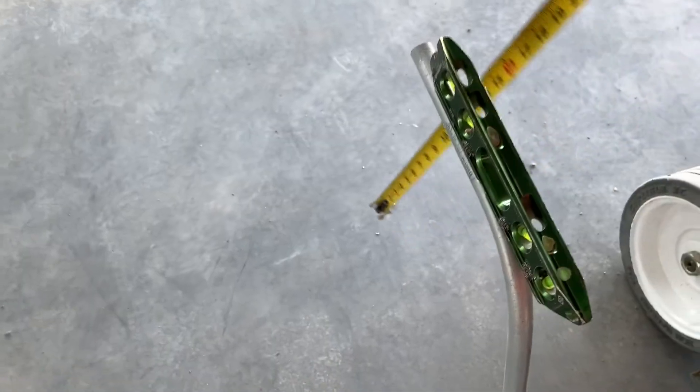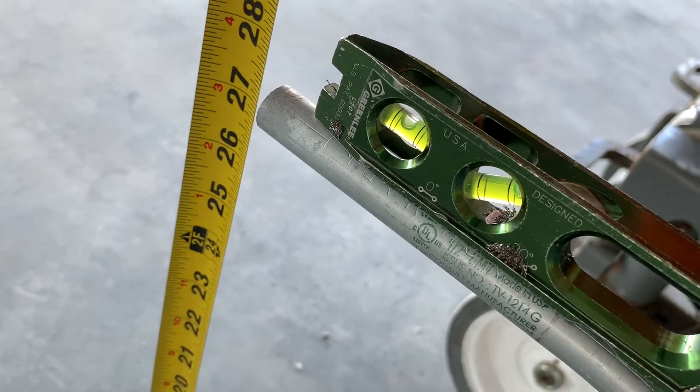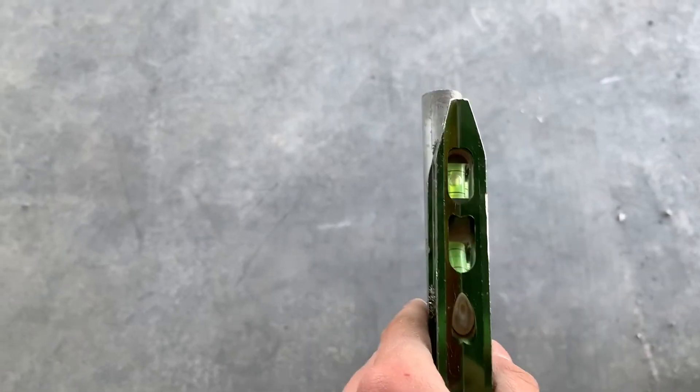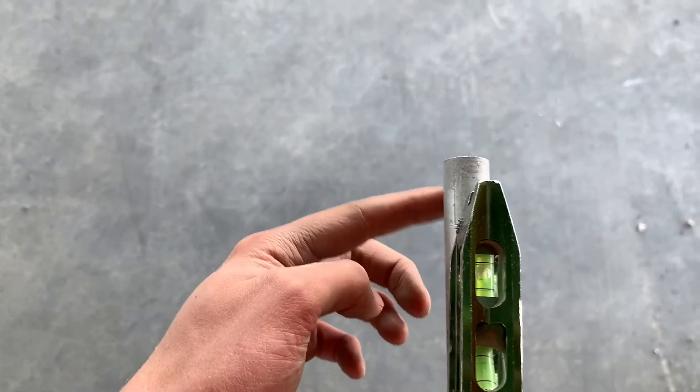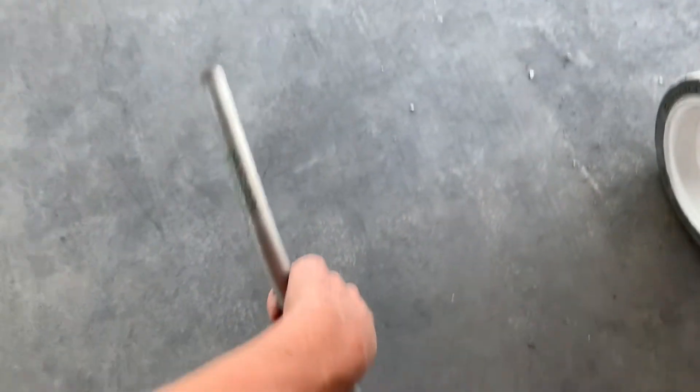I got my 26 and 3/4 inches, which is pretty much right there, and it's level — pretty level on the center of the bubble. If your pipe isn't straight, basically just stand on it and pull it up or down to adjust the bend. If you need to take some out, add some more, or pull on it, just make sure the end of the pipe is pretty level so you can get your measurement from the ground and go around the object you're trying to clear.